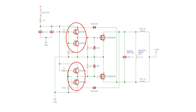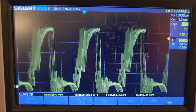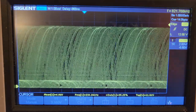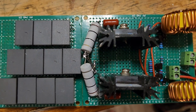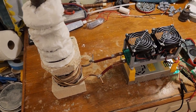So I got rid of the resistors and used a pair of transistors in a push-pull configuration to drive the gates, with a separate 12-volt supply so I don't have to worry about down-converting the 48 volts. The circuit works much better with these. The only remaining problem was nasty switching noise appearing above about 24 volts, with peaks that looked like they go above the 20-volt maximum for the MOSFET gate. To soak up the high-frequency noise I stuck snubbers on both rails of the oscillator — a 10-ohm resistor with a 2.2 nanofarad capacitor — which damps out the super-fast ringing when the FETs switch on, without interfering with the main oscillation. Now the whole thing seems to be running pretty happy.